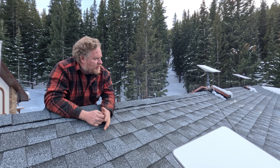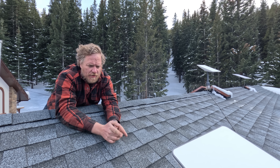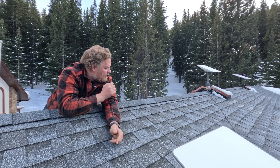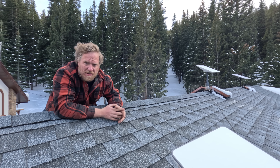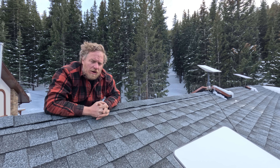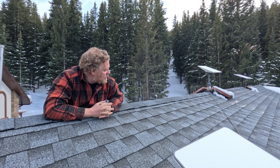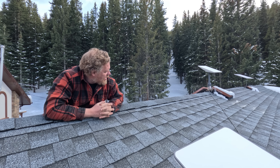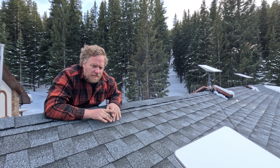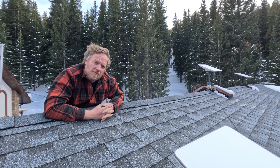You've also got to figure out how to mount them. One dish was already in place when we bought the property — it's just bolted to the roof with a roof mount that goes through the tile, and I didn't love that. I got these two folding ridge mounts — I'll put a product link below. They're nice folding ridge mounts that just use bricks as weight from the hardware store. If you don't want to damage your roof, drill through it, create a leak, or you're renting, these are a really easy mount.